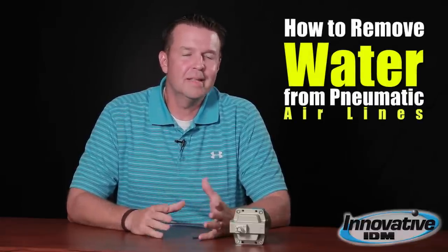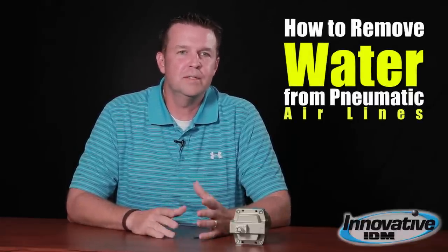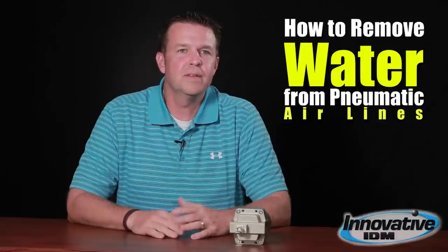Hello, my name is Chad Kaufman and I've been in the pneumatics industry for nearly 20 years now. Through my years I've visited many different types of plants and facilities, and a very common problem I get asked about quite a bit is how do I get the water out of my airlines? Especially in the south, as the temperature warms up, air gets heated and compressed in the compressor, then gets out into the normal atmosphere of a plant and facility, cools down a little bit, water forms, and before you know it you've got water running through your airlines and all kinds of problems soon thereafter.